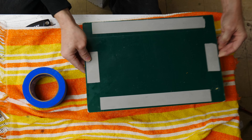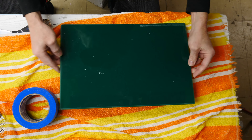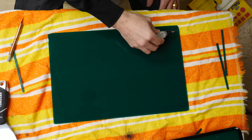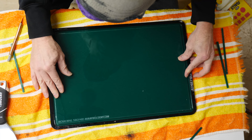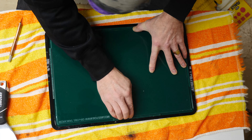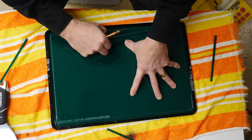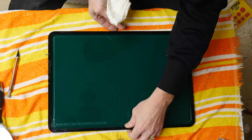I'm going to put some blue painters tape on the good surface just to protect it while I work on the other side so I don't scratch it. The tape comes off pretty easily and we pull off the protective backing. Now it's time to put this together — I put some solvent on there and use little spacers to get the correct spacing to place that piece in the middle. You can see the graphics; it all gets lined up, and we clean it with some Windex to get it nice and glossy and remove any residue. Now it's ready to cast our first part.